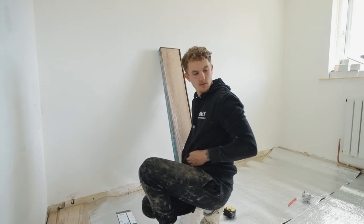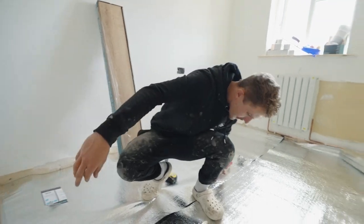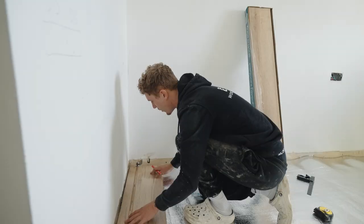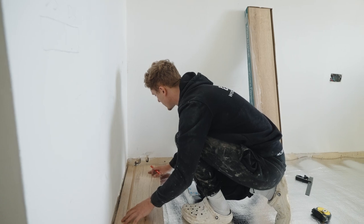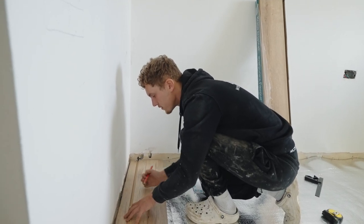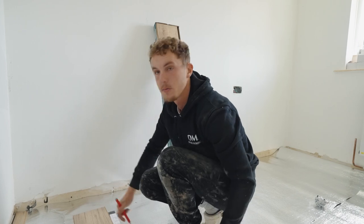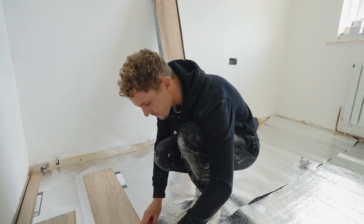What are we doing now, Jack? This is just marking in the cut. These are very easy — even for someone with a camera on there. What I'll do is I'll just flip it around, big tongue on big tongue. Give me my 10 mil gap. So you want the big tongue on the big tongue — mark it on the drawing. Once I flip it around, now that's my cut and that'll pop in there. If you're having to get a tape measure out, even though I've got one out, it's quicker.